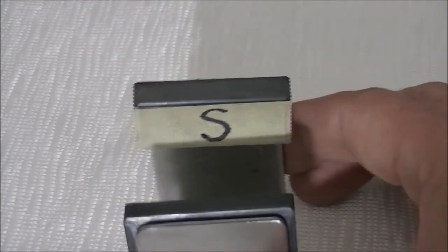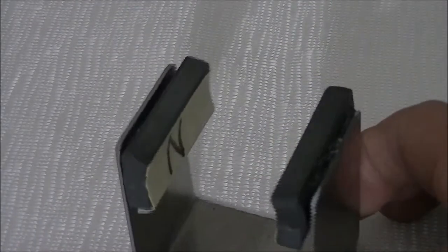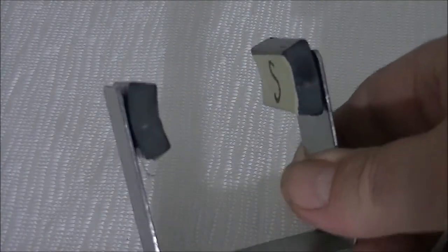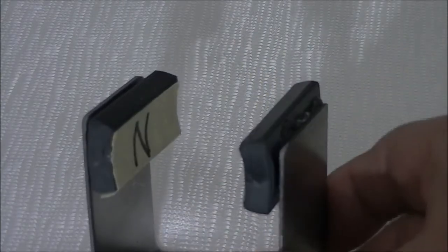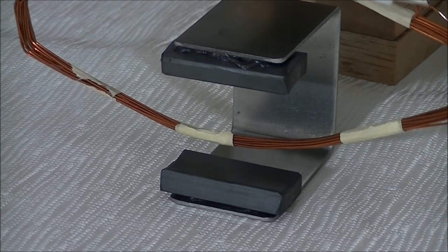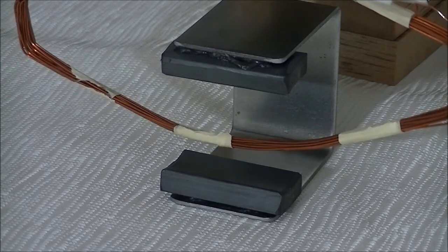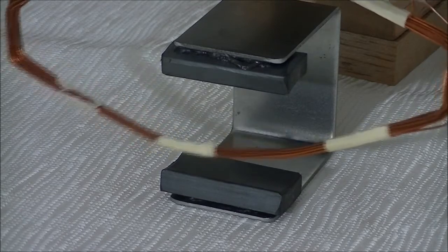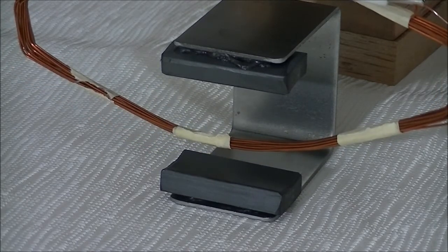For the next experiment we'll be using these permanent magnets. The magnets are set up so that they have opposing north and south poles, giving us a very intense strong magnetic field in between them. We can see here a coil of wire passing through that magnetic field. As soon as we pass current through the coil of wire it applies a force — an electromagnetic force — in between the coil and the main fields. When we reverse the direction of current it reverses the direction of force, and this is the force we use to make a DC motor turn.